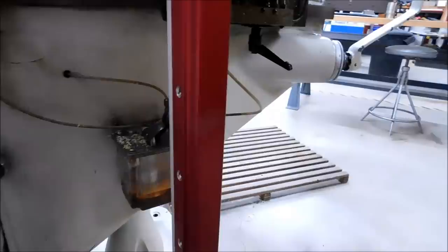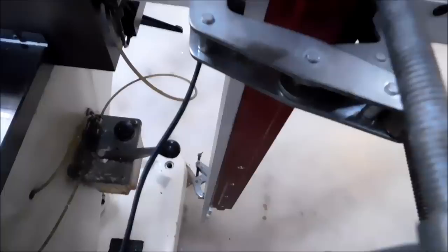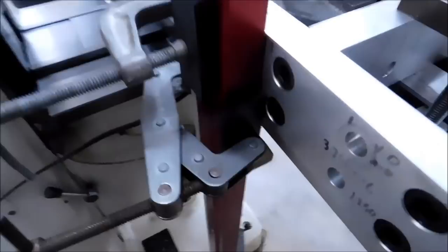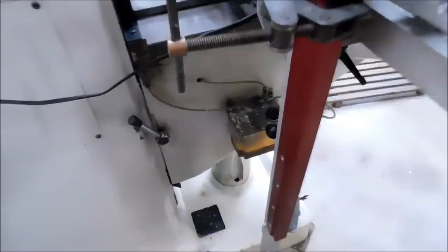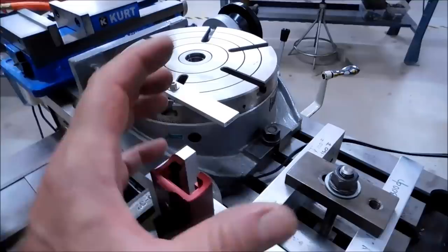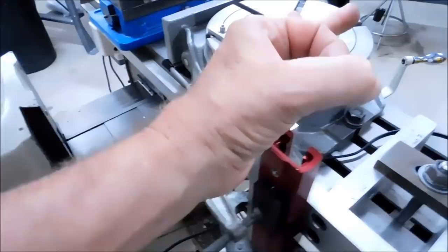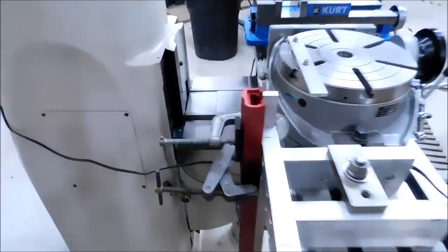This particular outrigger has just got a bump stop on the bottom and a pin for the parts it was intended for. You can see there's no way this is going to work in its current position — there's only about two inches of room on the bottom. Be very aware if you start putting outriggers on your machine of what's in the way. The only way to get around this is to swing the head — we need to get the spindle over here so this becomes the pretend center of the table. These two bolts and two on the other side will rotate the machine, and if the spindle is over here we can then telescope out into position.